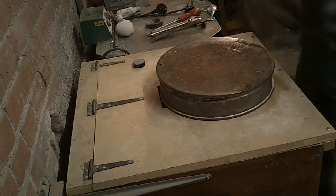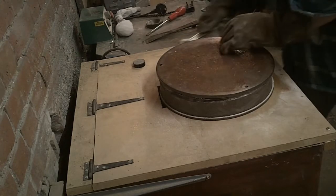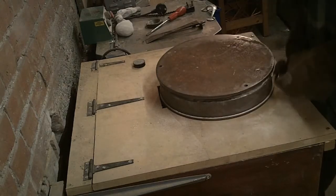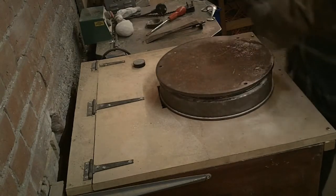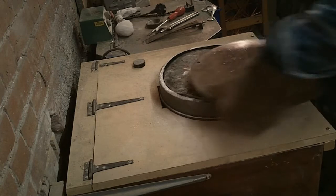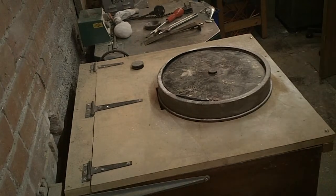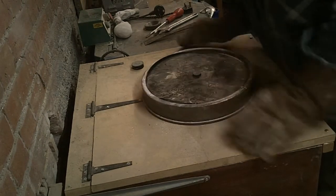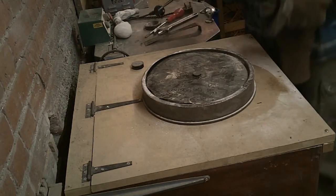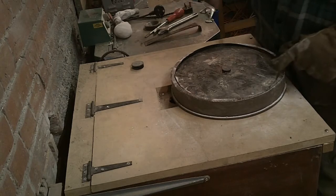Well, here's the moment of truth. The mould can has just come out and I'm now about to split it and see what we get. You have to remember this is 150 degrees — very, very hot. Everything seems to have vulcanised. Let's get rid of that. That seems to be okay. There's a fair bit of air in there which I'm a little concerned about — you can see it's puffed up.